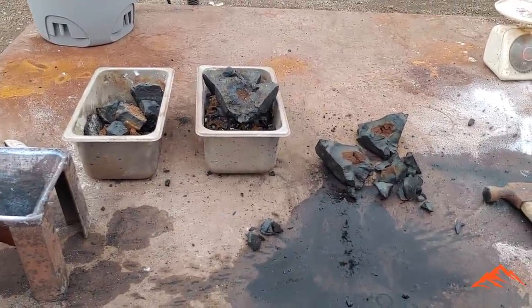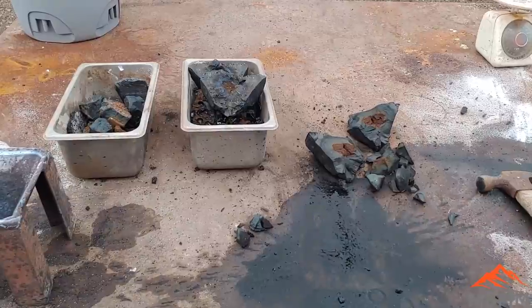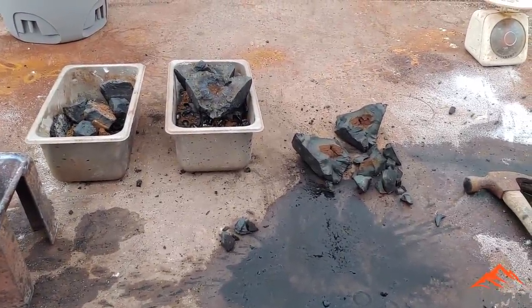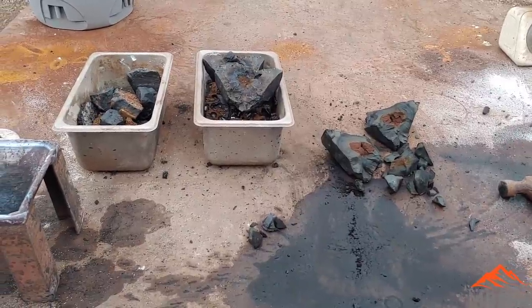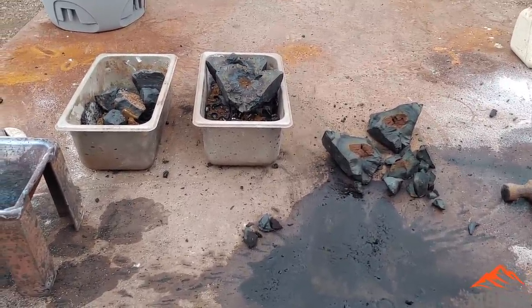concentrates. And altogether, we had 3.1 kilograms of concentrates we smelted down. It took me a little less than 3 hours, and I used roughly 4 gallons of propane. I started with a full 5-gallon bottle, and I still have about 1 gallon left or so.